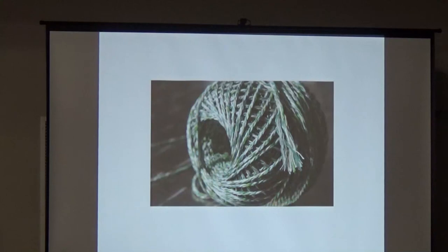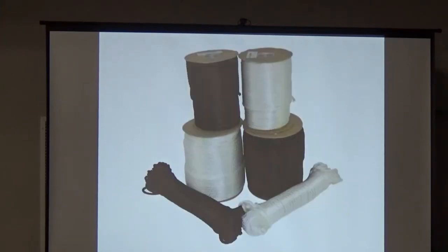Nylon packing twine will work just fine if you're putting up a temporary installation. That's what we use for Field Day every year. For something more permanent, you will want some Dacron rope that the dealers will happily sell you that's rated for exterior use. Otherwise, you get the surprise of having your antenna fall down. Be sure you hang your antenna so that there is some slack in it. You don't want to pull it tight. The wind is going to blow.